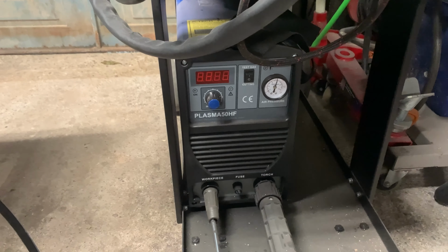Right, that's all the pilot holes done. These in the corners to mount the cylinders, they're going to be 11mm. A 10mm bolt should fit through, but I want 11mm for a little bit of wiggle room. Hole in the middle, like I say, they're going to be 50mm. We need the hole saw for that.